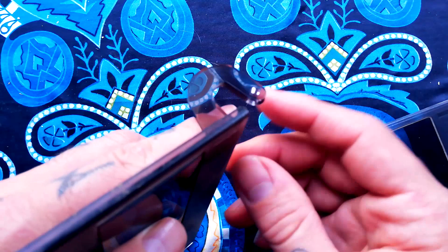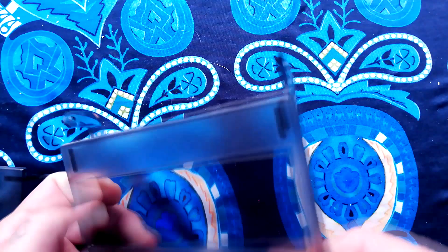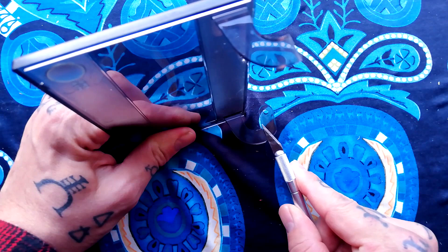There's a seam there. What I'll do is cut along that seam, and then on the broken one I'm attaching it to, I'll also cut along that seam. That way I know the proportions are right and the holes are going to line up with the mounting posts correctly.